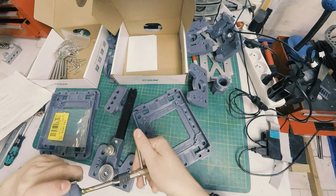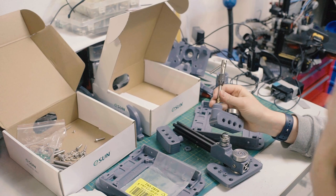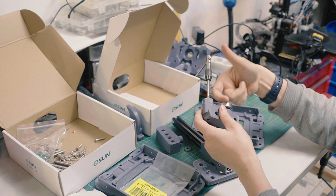Okay. Don't want to tap it all the way because I still want it to bind at the end, just enough so that the screw can go most of the way in. And here's another important thing that I believe is never ever use a tap with a drill. I don't give a shit how much time it saves. Don't do it. For the hundreds of hours that you save by using a drill with one of these things, it takes one broken tap to ruin your fucking life. So don't do it. It's not worth it.